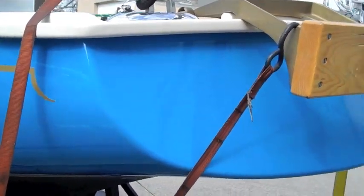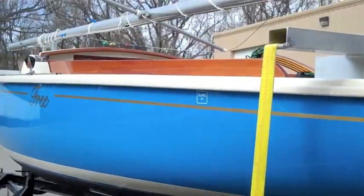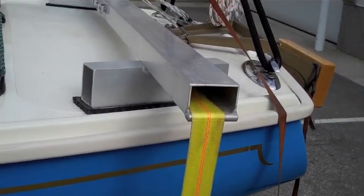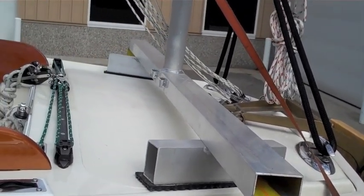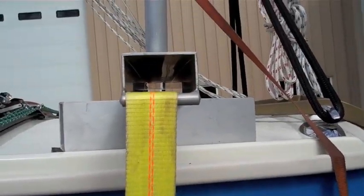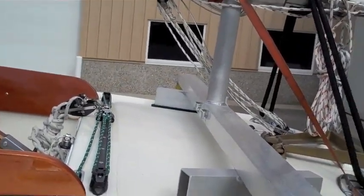The motor mount is able to be detached and put in the boat while you're out and about. I'm going to grab a ladder here and show you up on the top side. Here are those aluminum assemblies — they're inch-and-a-half by two-and-a-half tube stock, welded up with a crutch and then padded so the pads lay on the deck and the strap passes through to the other side, then goes down to the trailer and secures it so it doesn't touch.